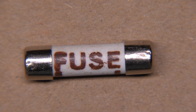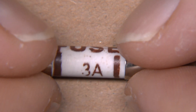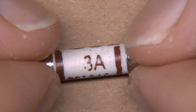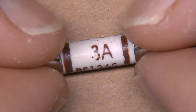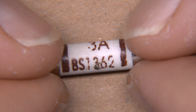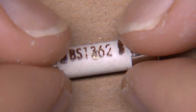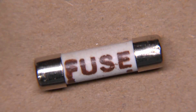In close-up, the fuse just has that big word 'fuse' rather badly printed on it. The end caps look scratched and dented and not particularly good. It says three amps, but as it's brown it should be a 13 amp fuse, so the actual rating is certainly not clear. Was the '1' rubbed off or never printed, or is it a three amp fuse printed brown by mistake? It claims BS 1362, but the general appearance is very strange — it's certainly not anywhere near a proper fuse.